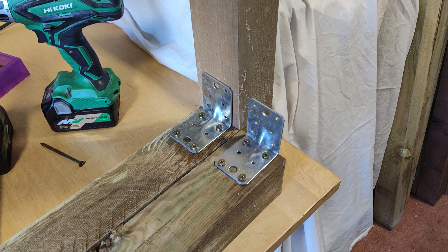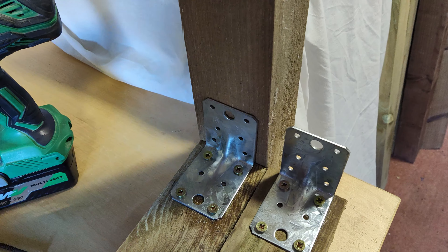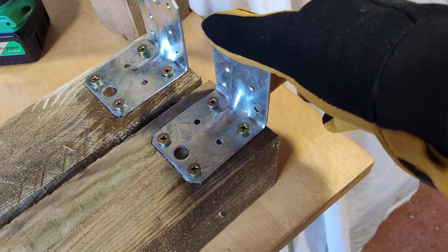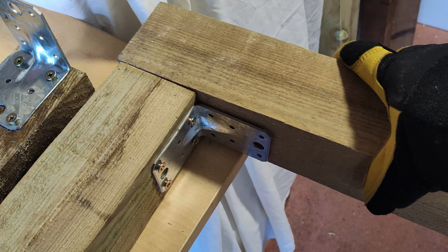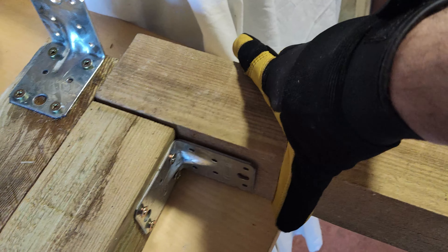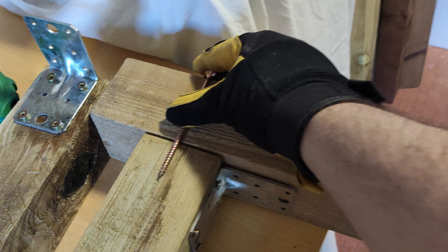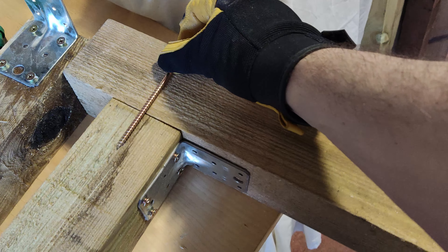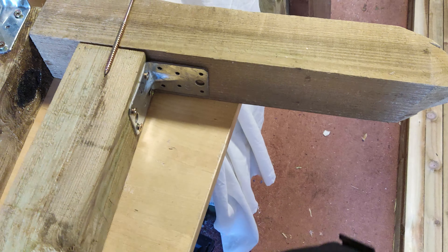So the first phase of creating the bed is to take some 50mm wood posts. Because it's a fence post, you want some pretty decent ones. These are just little bed corner brackets - they're really quite strong. So obviously that's going to be the inside, and my end piece that I'm going to cut out of another post will just butt up like this. I've got a good size M20 screw - I will pre-drill here first and then it will screw much easier, butt that right up and secure it. This won't turn - it'll be held really square and that will be my U shape for my pathway.